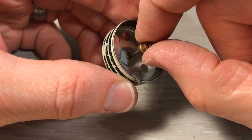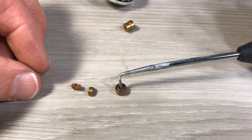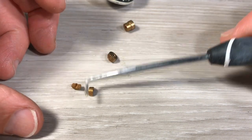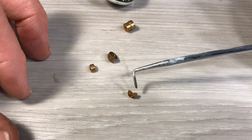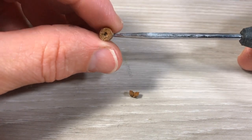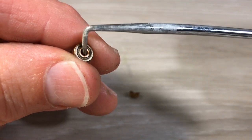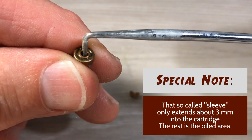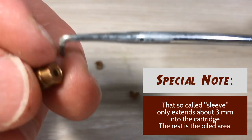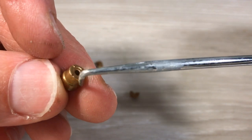What actually is that cartridge? I'm going to break one open so you can see. It turns out to be a brass bushing that's been impregnated with oil. If you look, you can see that bushing is interesting — it looks like a charcoal briquette. It's metal powder that's been compressed. There's either an insert or a part at the end that is like pure brass. You can see the charcoal-like texture — they would have infused that with oil. I actually put oil on it to see if it would soak in. So the axle rolls on that, and the oil gradually leaches out onto the axle. That's why these things have worked for 50 years. Eventually the oil ran out, so we won't be able to re-infuse the bushing itself, but we're going to oil it and get the oil down in there.